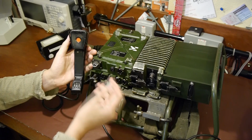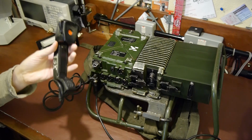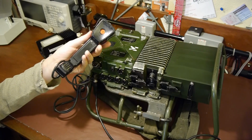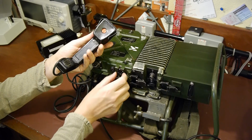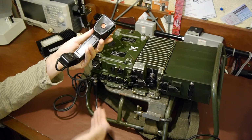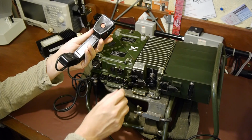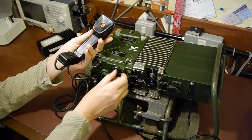It's kind of a squelch. It's squelch at the moment, so I'll put a star on, and hopefully you can hear that. So that's basically raising the squelch so we can hear anything. So when it's in loud or whisper, the squelches are set to preset levels, so the radio operates quietly. But if you just want to, I don't know, hold the squelch open, listening for a very faint signal, I guess, you can do that just by putting it on the star.